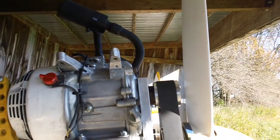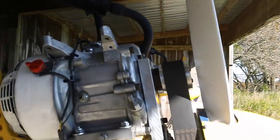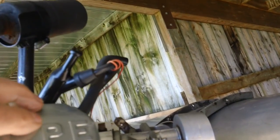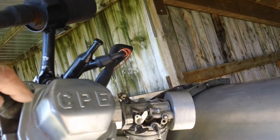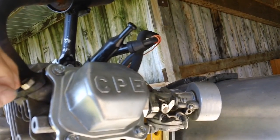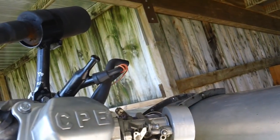When I checked them, the oil is right up to the top, which I think is way too much. This is maybe one reason why the tappet cover breather is spitting a bit of oil out. The heads are drilled — the oiling holes in the heads are modified to enable the tappets to get more oil. I think it's pumping so much oil up in there that it just boots it out.